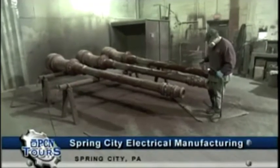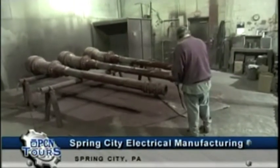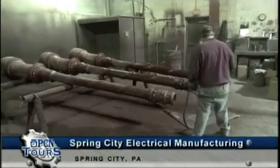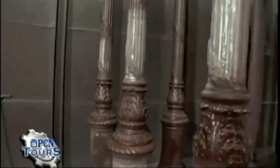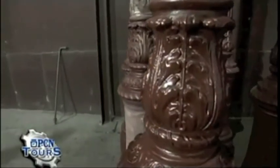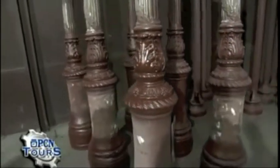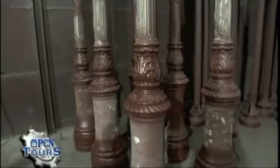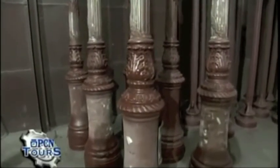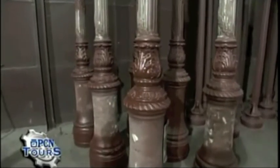Right now we're in the area that does prime finish painting. We're priming the Bishop's Crook posts and then we'll stand them up and our QC director and inspectors will come along and check the poles for any imperfections. We prime the poles before inspecting because the prime paint shows imperfections better — it doesn't hide any of them. They'll come along with a black Sharpie, mark areas that need retouching, send them back to the finishing room, and then bring them out for prime painting again. We believe this extra step is necessary to ensure the customer gets a product with an elegant cast and ornate detail.